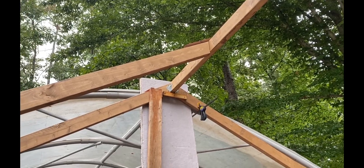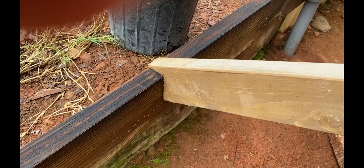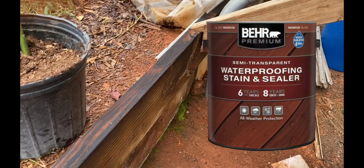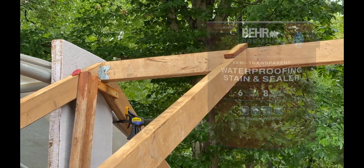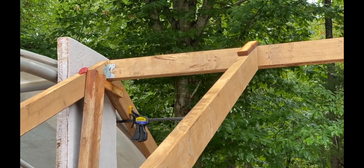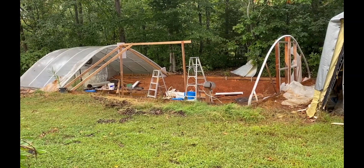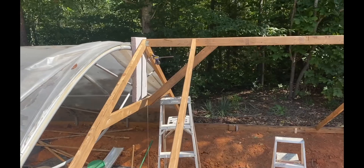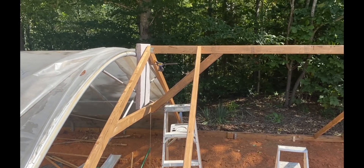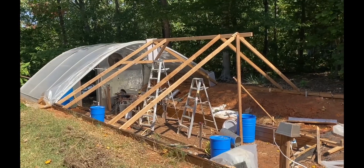With the new build I made it shorter and insulated with 1-inch polystyrene board. I decided to build with wood, so all of the wood surfaces are covered with deck sealer for moisture protection and appearance. I recut and stained the rafters in the shop. I used bracing and clamps to line everything up as I go. I thought I could offset the back rafters from the front but changed my mind and corrected them mid-course. In doing this, the foam board seams don't line up with a rafter.